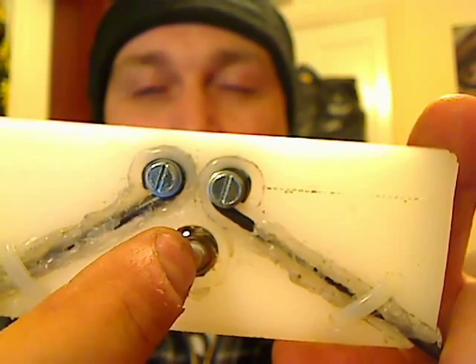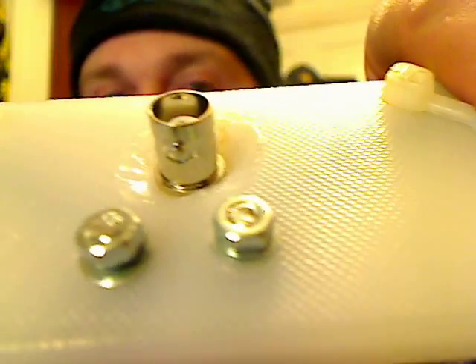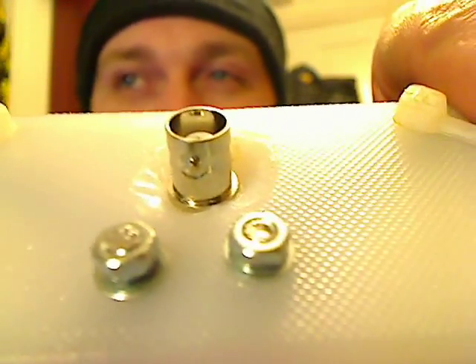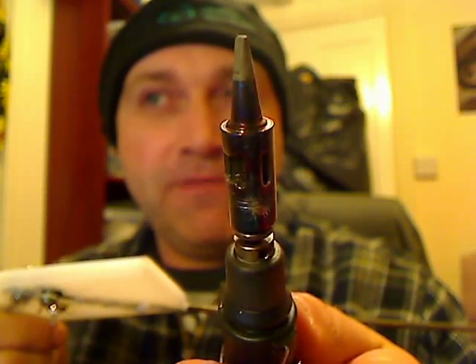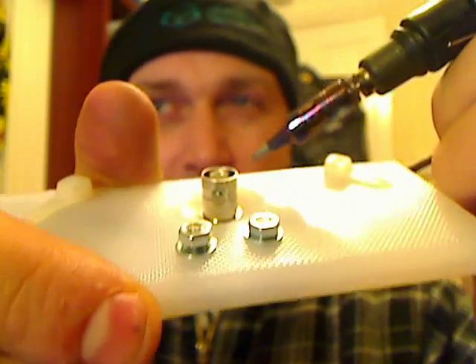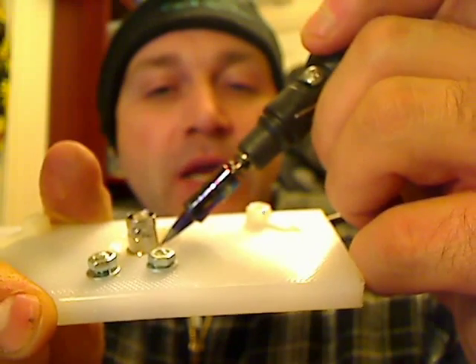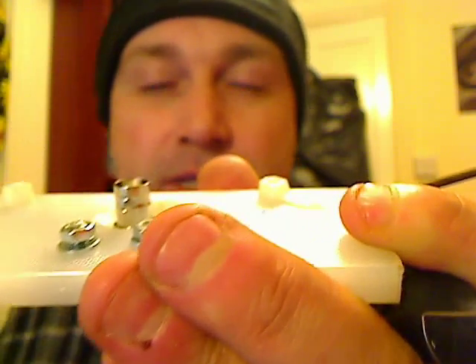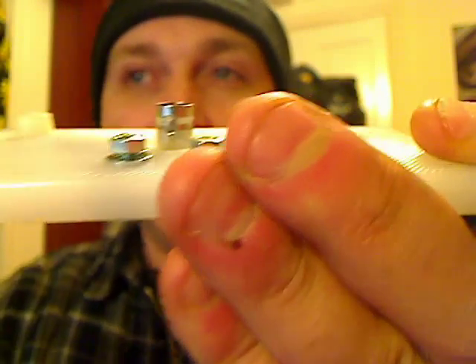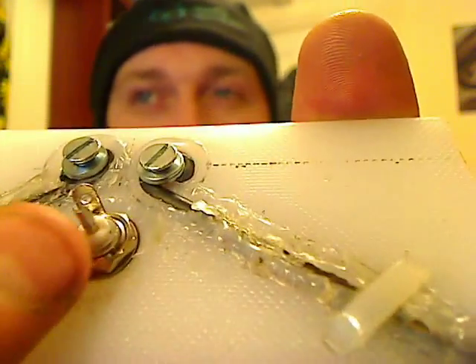You need to get a bigger drill bit and drill a recess because the BNC connector fits down inside. I didn't have a drill bit big enough, so I used a gas soldering iron — it gets very hot and you can gouge out the plastic by working it sideways, flicking material off or moving it to the edge, then cutting the edge off with a Stanley or craft knife. Then fit the BNC through and screw it up on both sides.